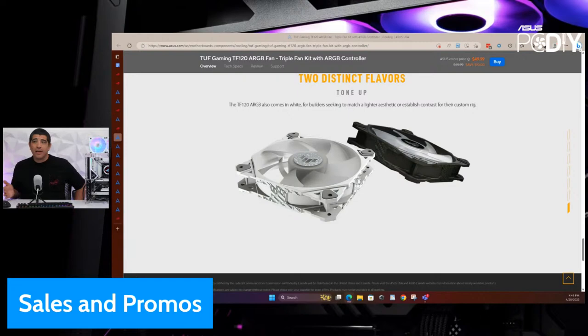We can actually hit about 7,000 MT/s even for more entry boards, like let's say a Prime motherboard. But similarly, if you put that on a Z790 motherboard, of course, you have to account for memory controller variance, because different memory controllers sometimes can get a little bit higher in frequency. Some operate a little bit lower because you're talking about overclocking, which isn't guaranteed, right? But you can see a higher likelihood of 7200, 7400, 7600. Now that is going to be in two DIMM configurations that are single rank. So that is going to be nominally things like 16 and 32 gigabyte kit configurations, and also potentially 48 gigabyte kit configurations. Once you go to 64, you see lower scaling, because that is generally going to be a dual rank memory kit. Okay.